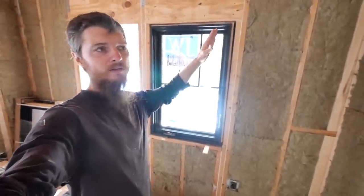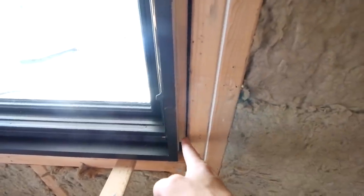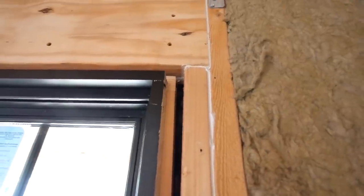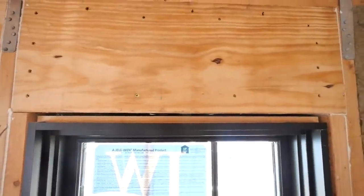The roof stayed still, so all the studs were at a slight angle, and you can really see it, how tight the crack is right here. And then as we move up to the window, super wide up here. Almost probably 1/2 inch over here, super narrow on top, super wide on the bottom. The top and the bottom aren't too bad, maybe slightly off, but not too bad. Sometimes you just have to make do with what you have. All the studs are like that evenly, and even this outside wall has that same lean. And it corrects itself as it goes down the wall.